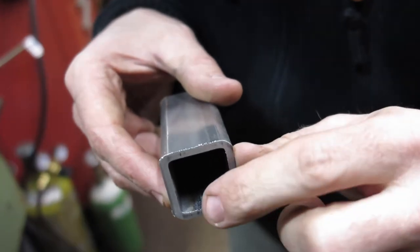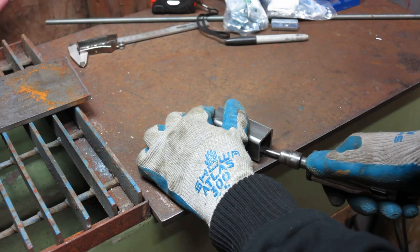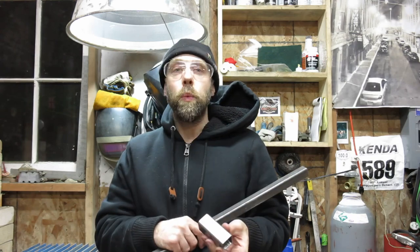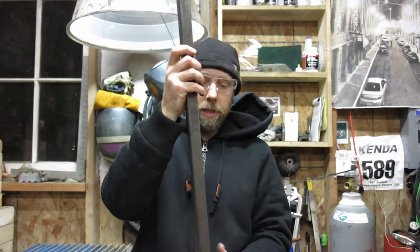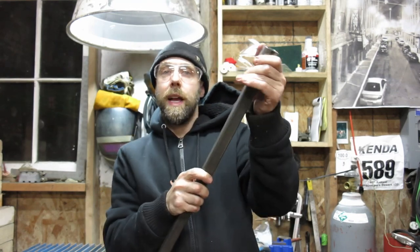So that's a little weld seam we're going to die grind out. 31 inches. I did a little more die grinding than I thought I'd need to. Usually you can get away with just grinding the weld off. But I had to grind two sides of this down a little bit with the die grinder. If you do start fitting these things, mark them with a Sharpie so you know which side, because this is the side I fit it to. Maybe you can see it slides nice, but if you turn them sometimes they hang up. So make a point when you die grind them to fit them to a matched size.